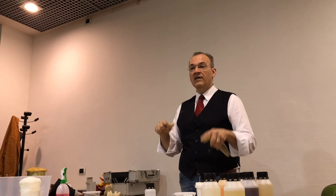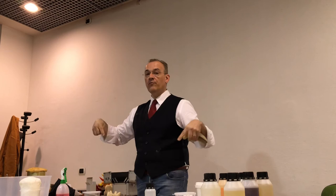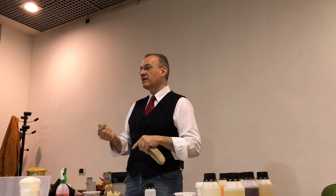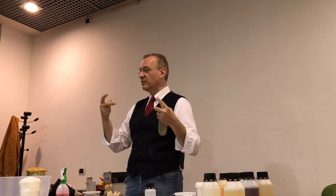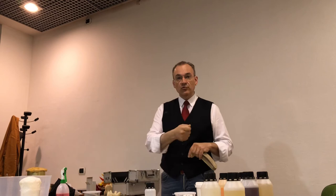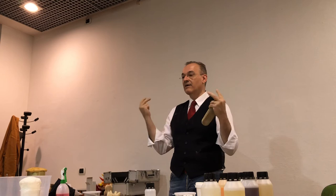If I put resin now, that we are a lot of people, we make a lot of humidity with our breath here, it will expand much more than if I was alone. If I was alone, it will expand less. With all this humidity, it feels it and it starts to react more and expand more. So you have to think. If you are making your mold on a rainy day, pay attention that it's better to dry it before, or you will have uncontrolled expansion. Okay.